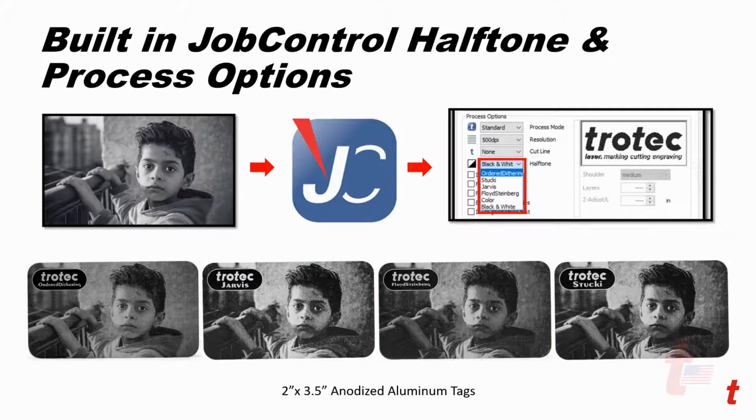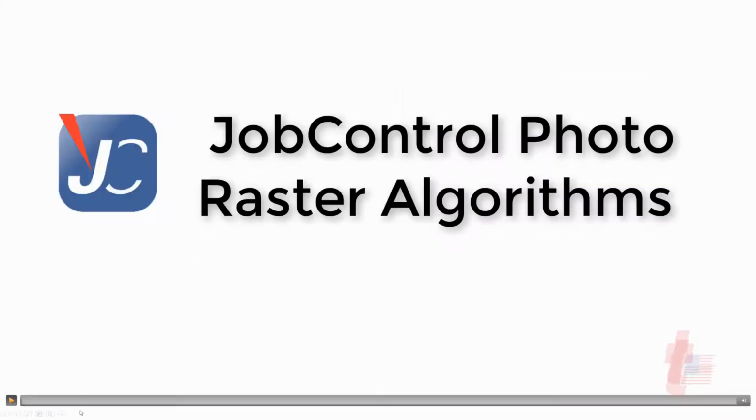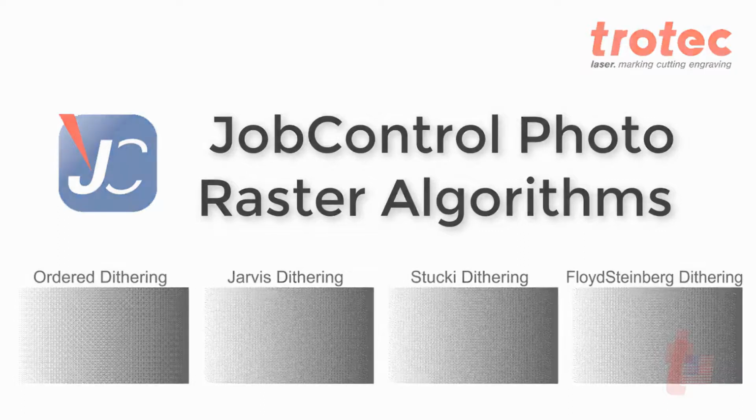And I'm going to show you the process of doing this by utilizing the photo optimized process from the Trotec JobControl driver. So when you actually send a job, you can turn photo optimized on, and then we can control the type of halftone to get the different photos. And so here's a quick video that is going to show you the process of the raster algorithms using JobControl. JobControl photo rastering algorithms are built directly in.